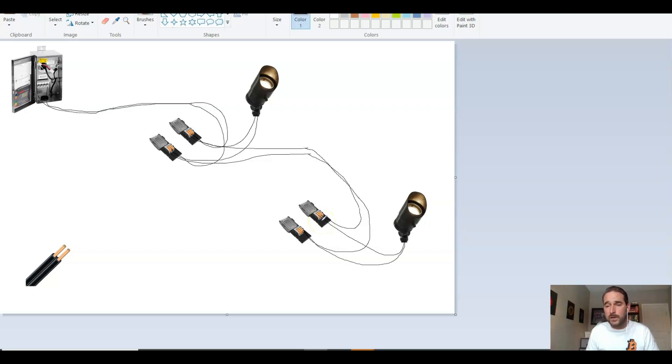Say you weren't sure yet and wanted to keep that line going because you might add a light later — you can totally do that. You can have your 12-2 wire going out, but you're going to want to dead-end it. Now, sometimes people say they'll put one connector for both wires to save connectors, but if you do that you're going to short out the whole system. So you still need two connectors — one on the end of each wire. Or you don't even need to do that; you can just end at that last light with no wire coming out.